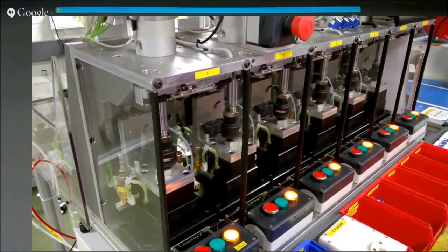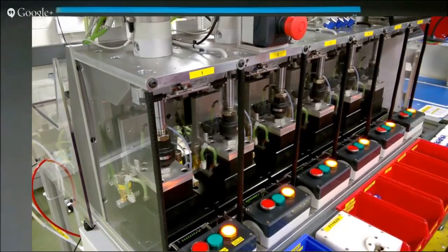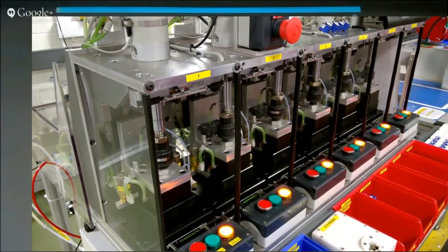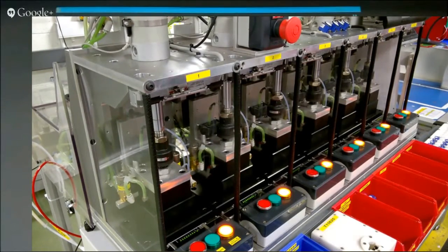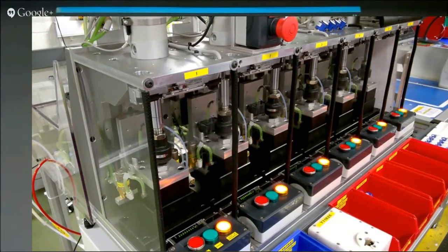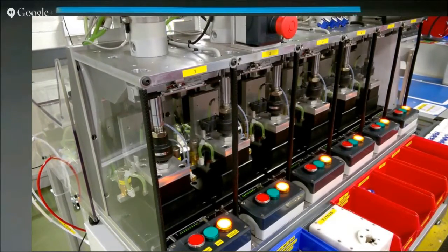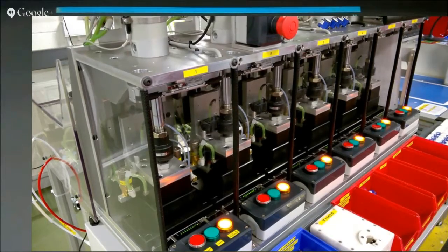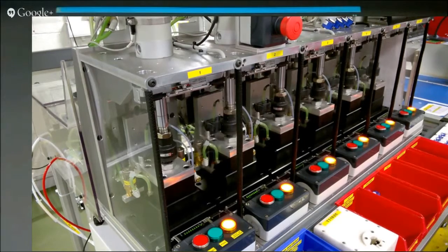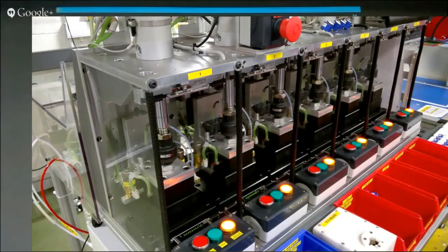The gases are calibrated. These are oxygen sensors, so we typically use a nitrogen cylinder and a 21% oxygen cylinder. We make other products with different gas concentrations, but these sensors are measuring ambient oxygen — typically around 21% all the time.